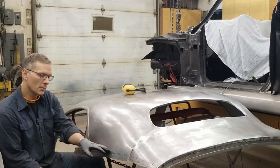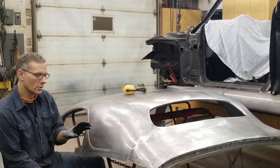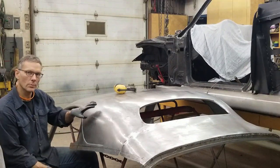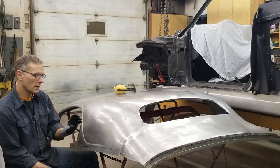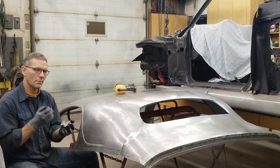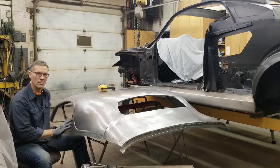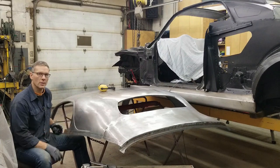After we put it through the tipping wheel to create that feature, we stretched the material. And if we just kind of hammer it out, we'll end up with a bulge through here, and we don't want that. We want the roof to come down smoothly into the shoulder line. So what I'm going to do is basically hammer the material into itself very carefully by hammering onto the dolly, but not peening it. Because if you peen it, you're going to stretch it. We might actually have to use a shrinking disc later on, but let's see how far we can get with just a hammer and dolly.